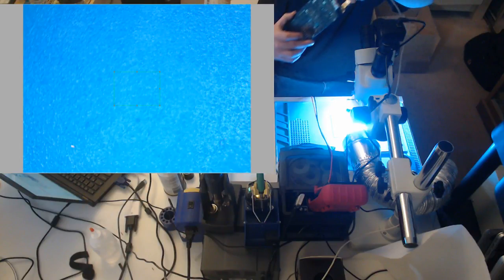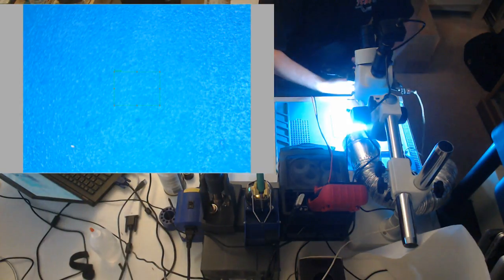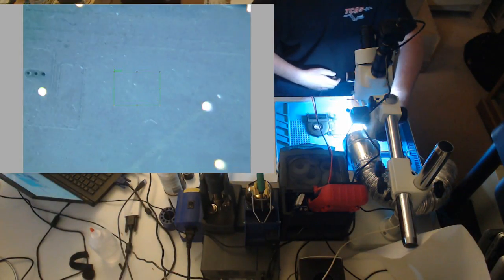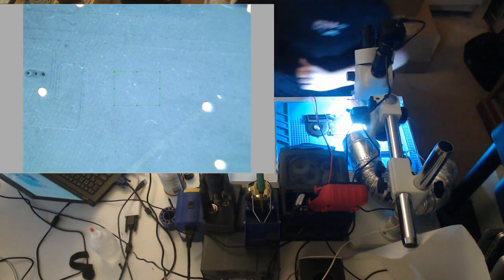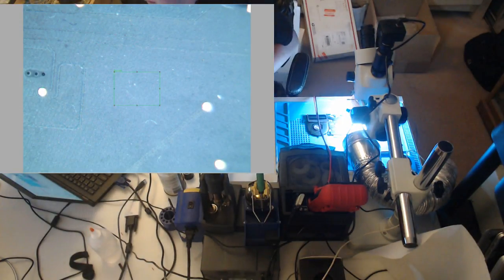You guys can see the orange light, and our fan is not spinning, our CPU is not getting hot, so it is not getting power. So first rail we check, we know we have PP3V42 because we get a green light in the charger. So our first rail we need to check is PPBus G3 hot, because that is our main 12 volt rail, and without that nothing else will work.